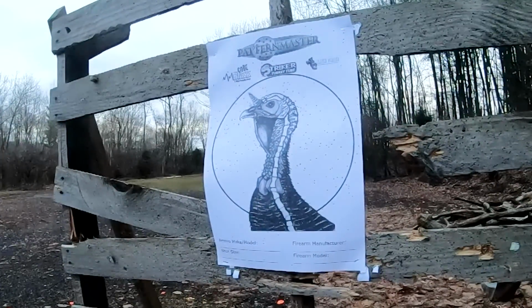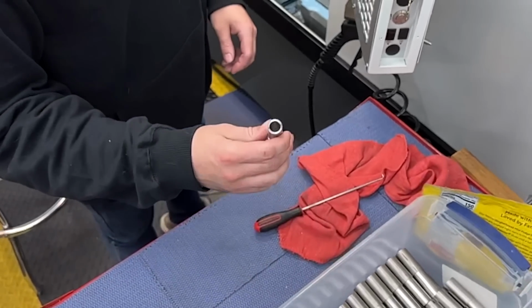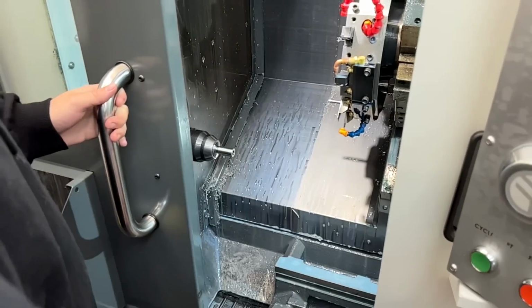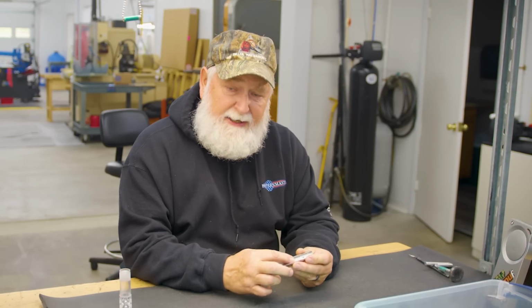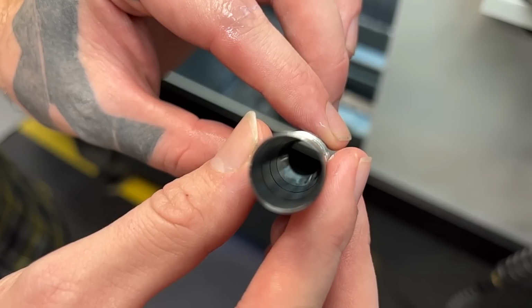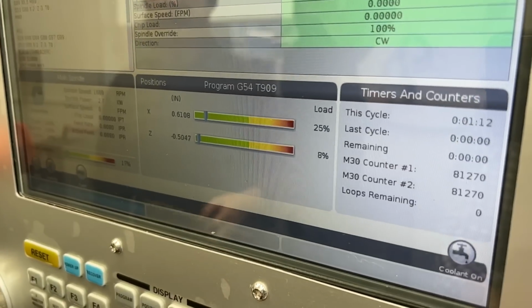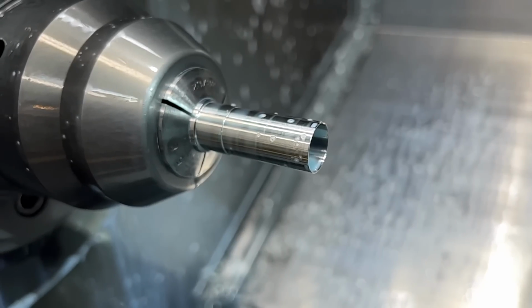As with almost all of our steel, we only use 17-4 PH stainless. We go through an American steel broker that only deals in US made steel. As we go through here and taper, we put these steps in there. And that gives the wad a chance to step itself back away from the shot as it's going through. But it was a good move for us. It was a challenging move, continuously challenging.